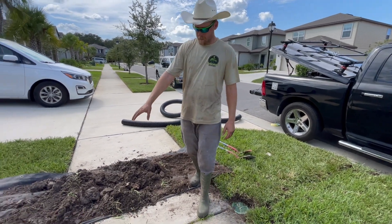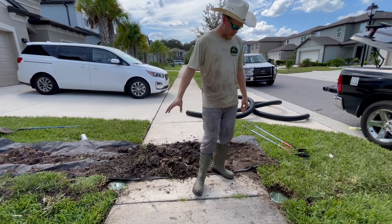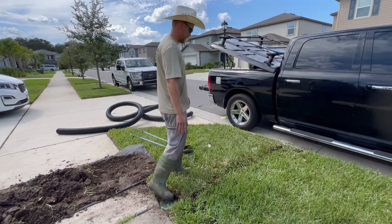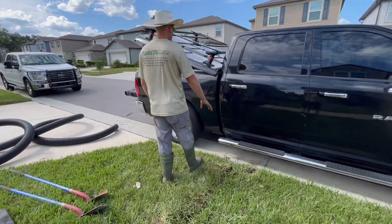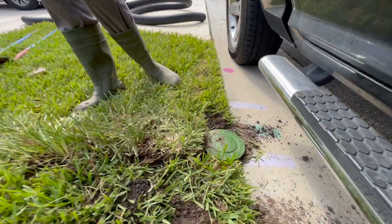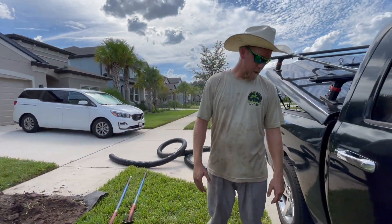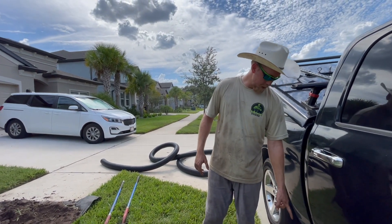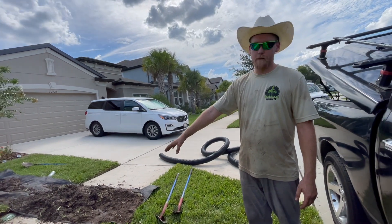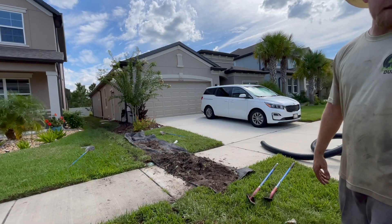What we've got here, like Nash explained earlier, is a pop-up. This is going to let the water come out here onto the concrete and flow all the way down to where the low point is. We put a catch basin and that's going to come all the way out, popping up here at the street. We like to do this when we cannot go underneath the sidewalk. For this specific instance, we can't go under the sidewalk because both of the main water lines to each of the homes go directly underneath this section of sidewalk that we would have to bore under. So that was a no-go — this is the next best thing.